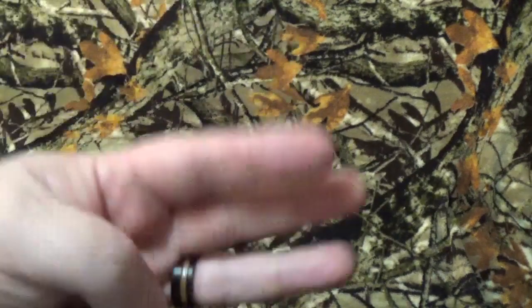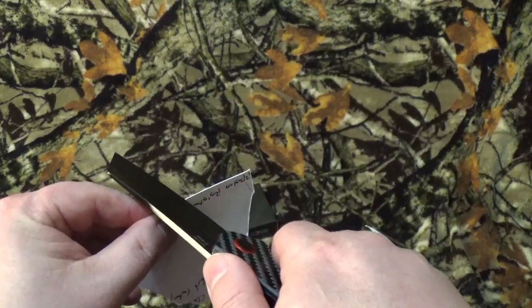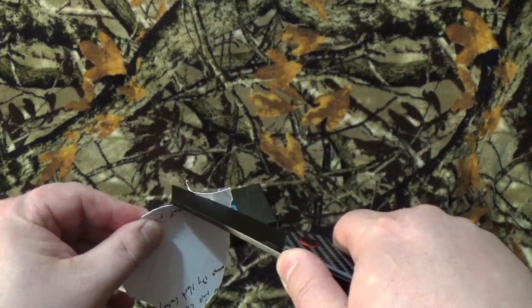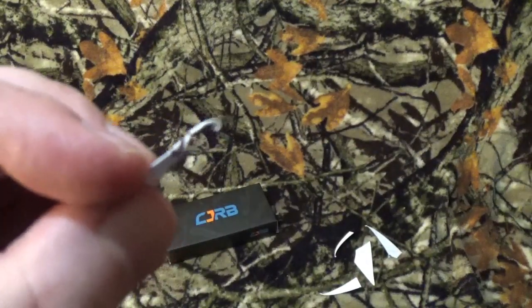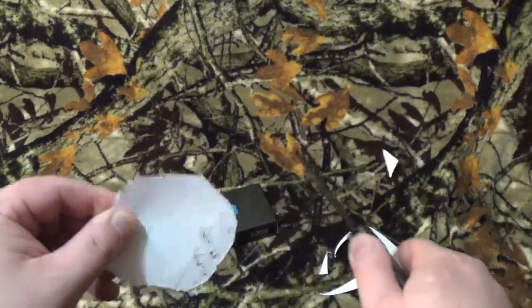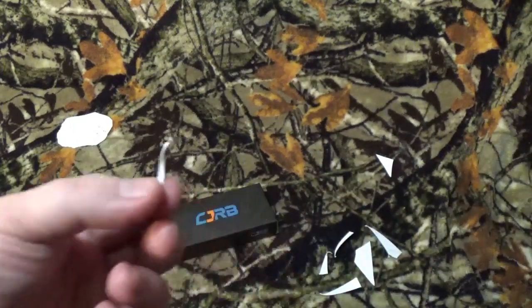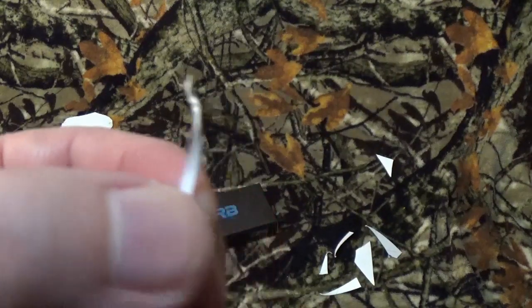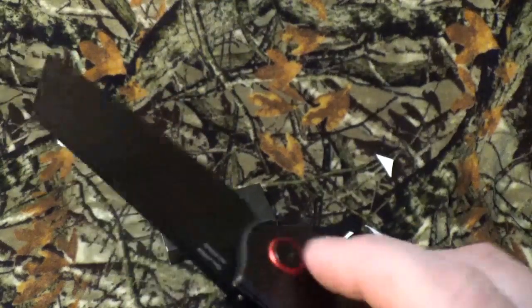Let's get on to the cut tests. First one — somewhat heavy-duty stock paper. It just burns right through it. Let's see if we can get a curlicue — it really wants to eat into that paper. Basically, if you drag that blade along at the same angle really, really slow and do it just right, that paper should curl back in on itself. That shows there are no micro abrasions, chipping, or pitting, and that your blade is good. Not really seeing a lot of snowfall on there, so okay.